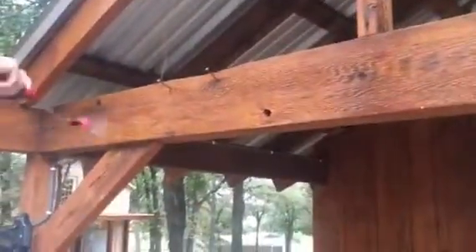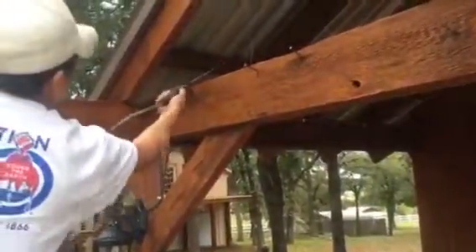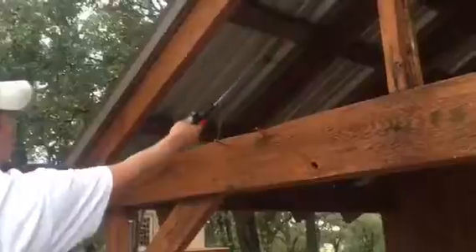Just pour it on there so that we can come along and power wash to get this clean, and then we will have bare wood. It's 100% covered with this bleach water solution — 50% bleach, 50% water. It's usually a little stronger, a little less water, but 50-50 is the idea. I've already got bleach on me three or four times, but it's what I do to show you the difference with Christian Painters.